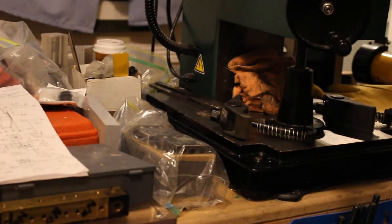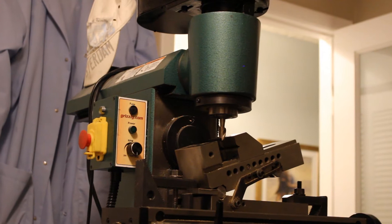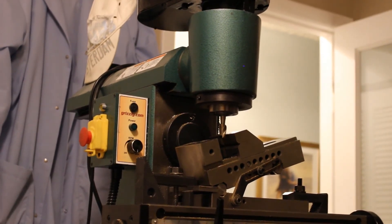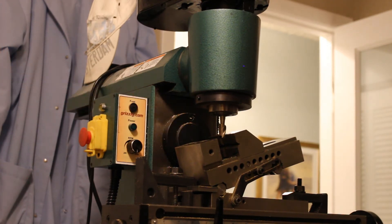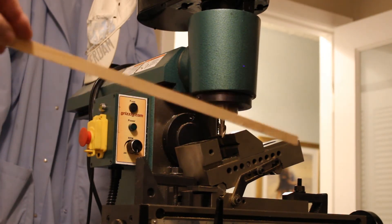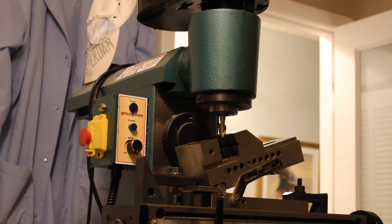This particular milling machine is a horizontal or vertical mill. Right now it's set up as an end mill. It can also be set up with a shaft that comes out here — if I take that plastic plug off, move the motor to the back, a shaft comes out and there's a bearing that mounts on it, and I can cut gears and things like that. I bought this machine because it's horizontal and vertical, giving me versatility to do prop stuff. If you have space, you can always buy a horizontal and a vertical separately.